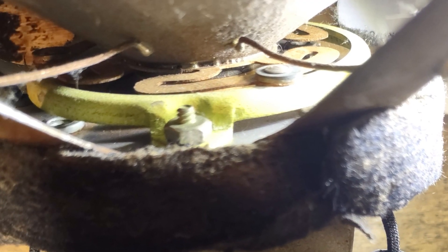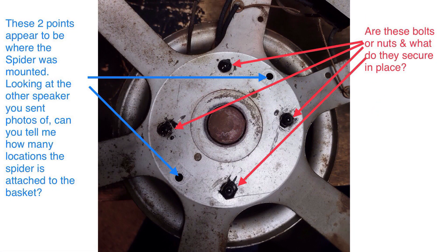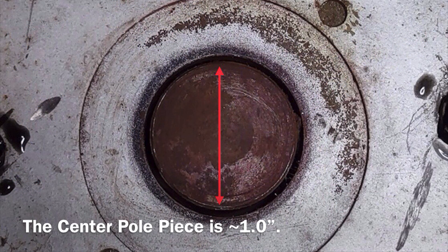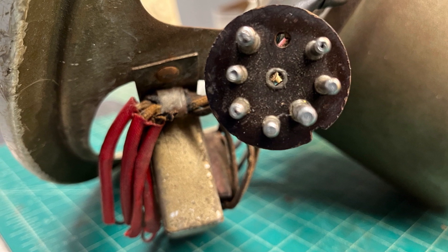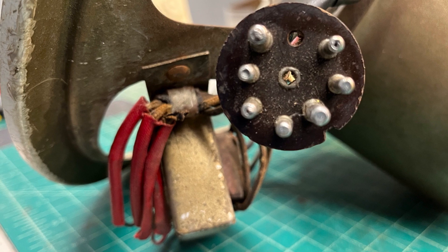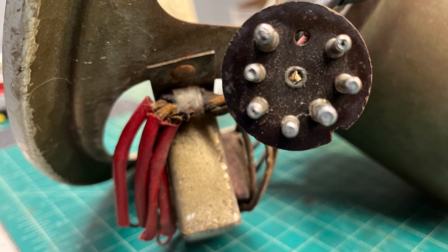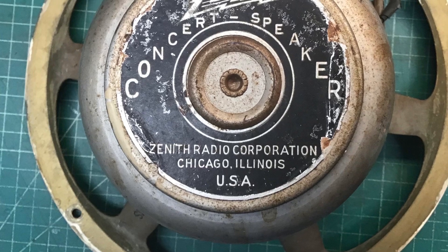As we were conversing back and forth, you can see an example of another loudspeaker — the spider and the mounting ring. Here's some other photos where I was asking questions. You can see the area to the left in blue — I think that was the two supporting fasteners for the spider bracket or ring itself. And a closer look at the center pole piece; much debris there in the gap. That magnetic gap will need to be cleaned out. You can also spot a lot of rust and discoloration — so it looks like this speaker was at some point exposed to moisture or a wet environment.